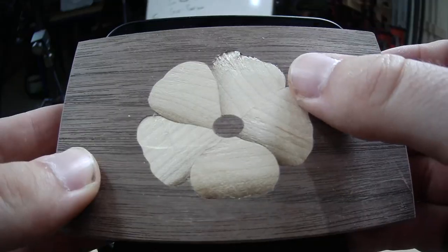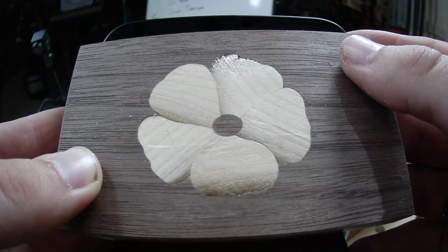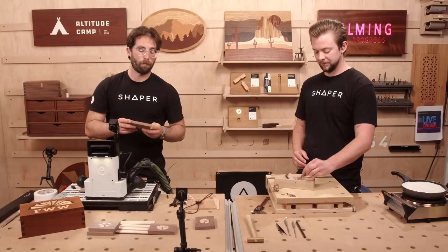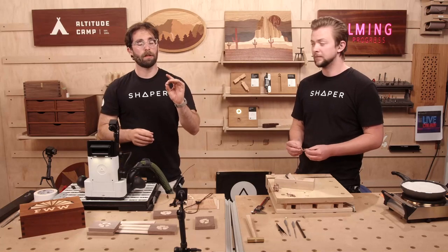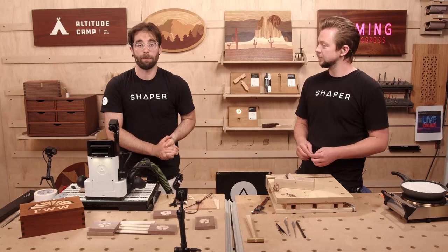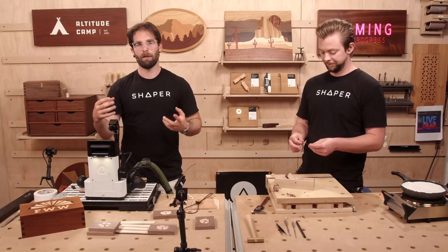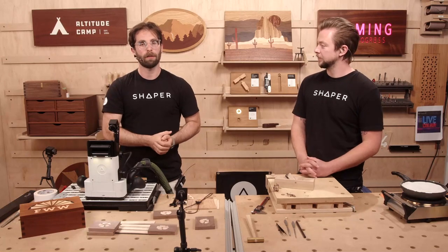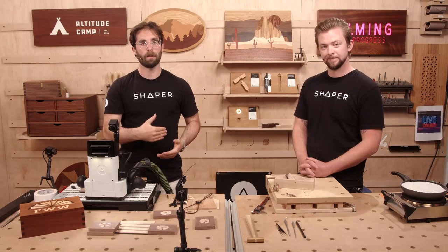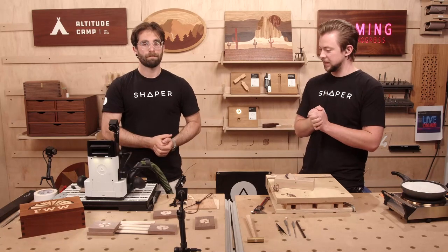You all can see that — learn from my mistakes. If we plane that down just a little bit more that tear out would go away. Scrape it or sand it always. This comes back to a fact that I love about sand shading: when you sand shade, that shading goes all the way through the thickness of the part. We weren't even sure about this when practicing earlier. It made intuitive sense that the shading would be on the outside and might not come all the way into the center on an eighth-inch piece, but we proved it's dead even all the way through. Sand without fear — shape and sand away.